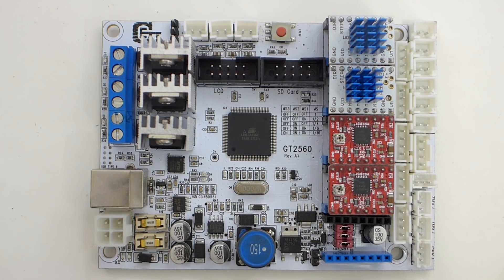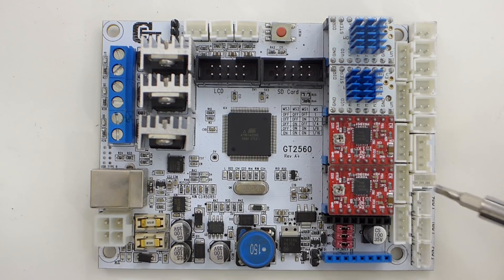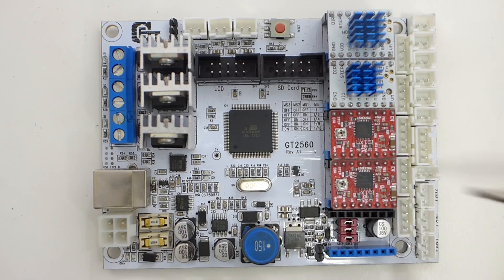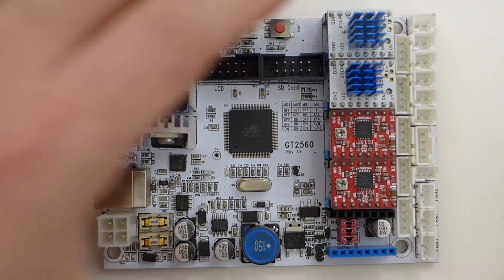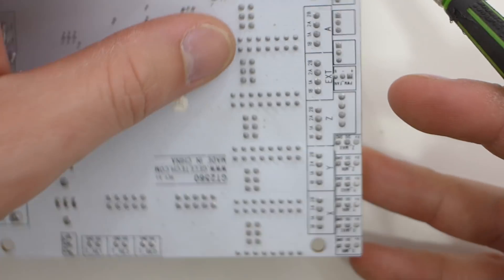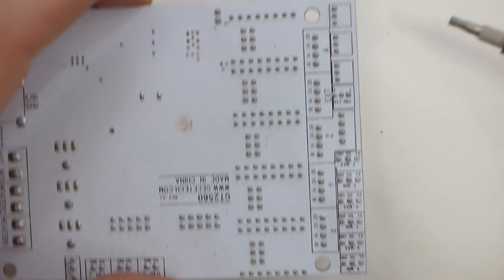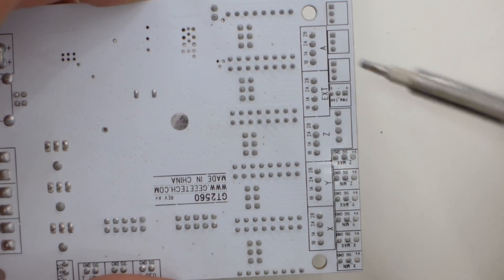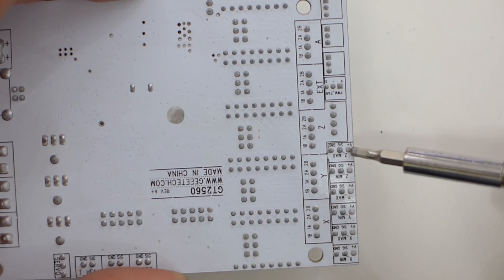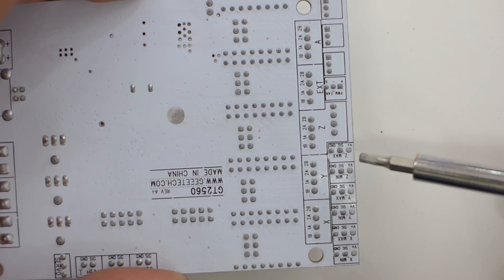There's a little chart right here for microstepping. Over here are all the hookups for your thermistors, your different fans — this is your part cooling fan — and all of your steppers hook up right in here. These are limit switches, and these up here are thermistors. The nice thing I really like about this board is that everything is labeled very well. When you flip this over, all the hookups are labeled — extruder, second extruder, Z, Y, X, and all your Zmin, Zmax, min and max for all the axes.